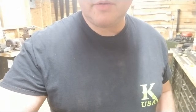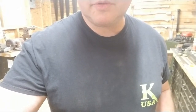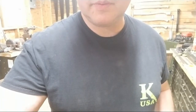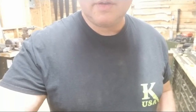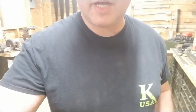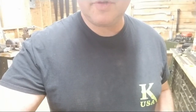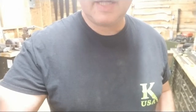The craftsmanship hang that you spoke of is good. I was able to extract the factory metal wedge and use the original handle. I set it down 1/4 inch, no voids. Very good. Nice. Rebuilding saws, I use denatured alcohol, evaporates fast. More just to clean up before you stain it. Yeah, that's a good idea too. Denatured alcohol, I just don't have any.